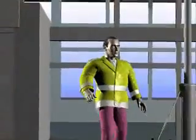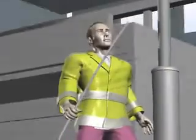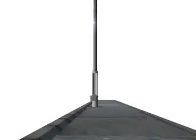Using leading-edge electronics, it makes the structural examination of streetlights fast, efficient, and cost-effective, and provides reliable statistical information on the condition of each column. The remote field eddy current effect behind dipstick technology is more commonly found in the oil and nuclear industries, where it's used for finding cracks and corrosion in pipelines and tubes. The principle is just as effective in the high street.